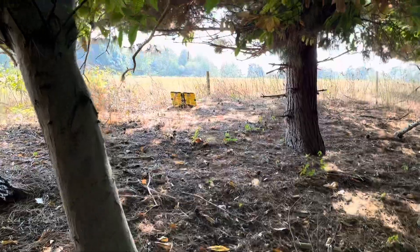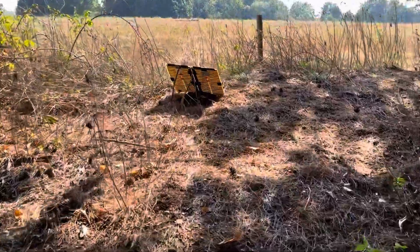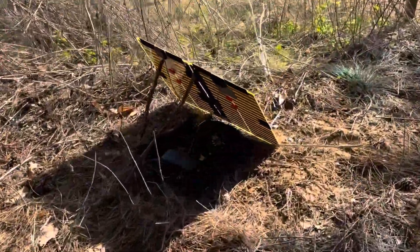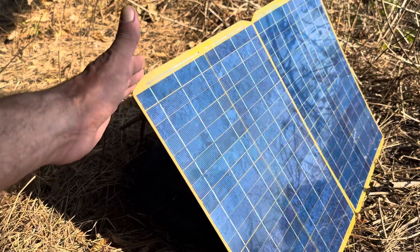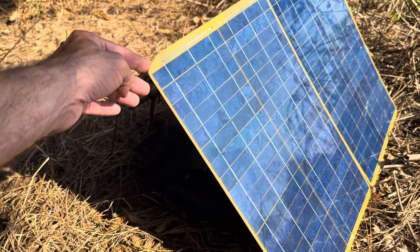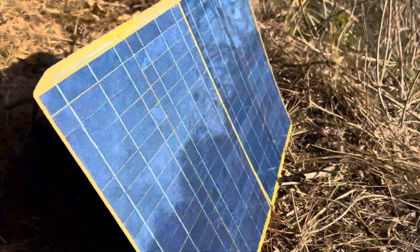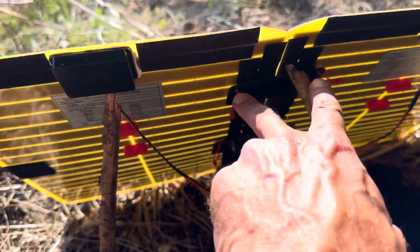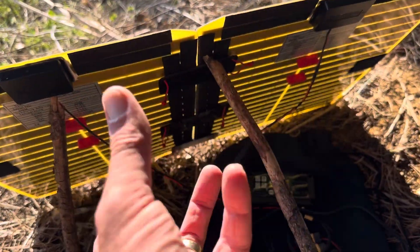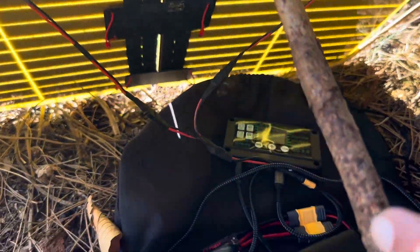One of the things I wanted to try today on my wild camp for 2024 is the new solar power system for my bushcraft and wild camping. It's a nice small foldable DIY job — I've basically got two 20-watt solar panels that I bought ages ago and trimmed down slightly. It's thin epoxy fiberglass, trimmed to fit in my pack. They fold face-to-back, held together with velcro plates, and can be oriented landscape or portrait by rotating 90 degrees. They're wired in parallel, giving 40 watts total.